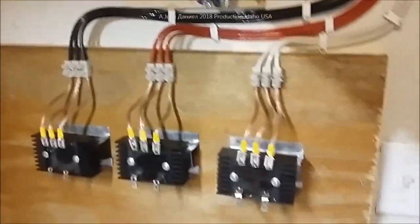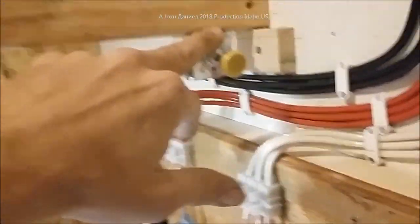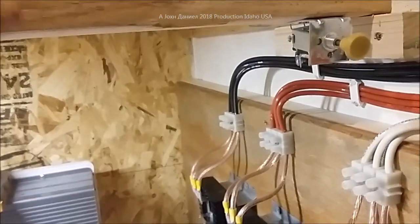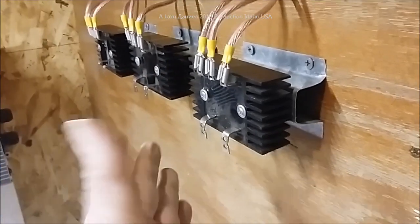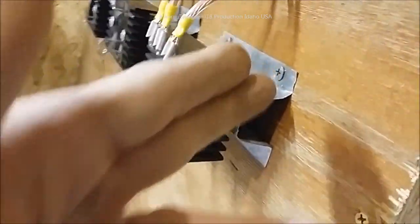The red and white wires are the ones we're going to bring over to the oldest turbine on the roof - the Thermodyne turbine, a Hornet Wind Thermodyne, whatever you want to look up. We're removing the switch and putting sheet metal behind here, notching it just for the wires, covering the wall back here just for fire prevention - because these can cause a fire. Be careful where you put them. These are mounted on hat metal - very nice setup.